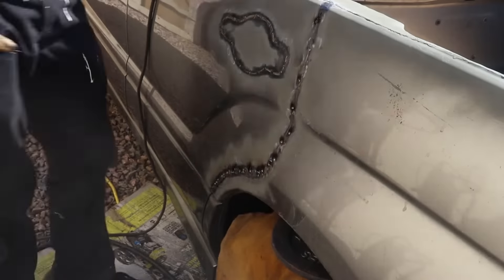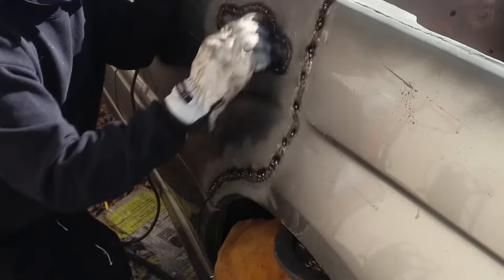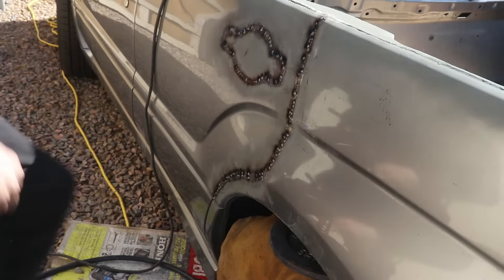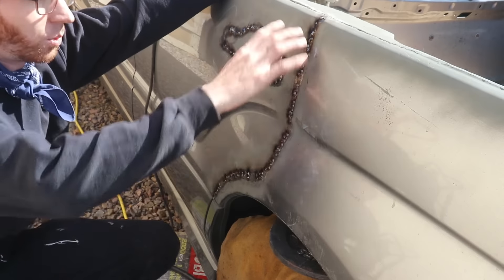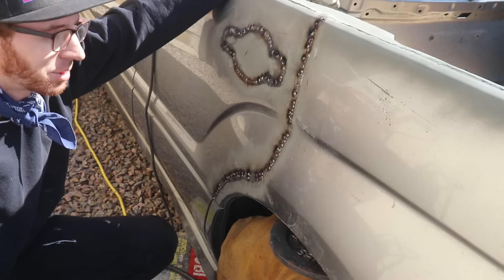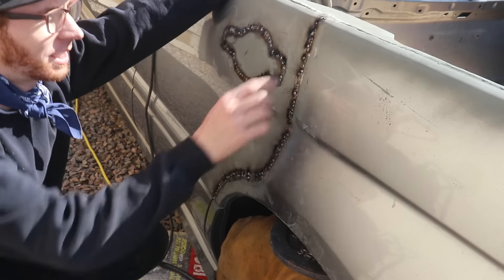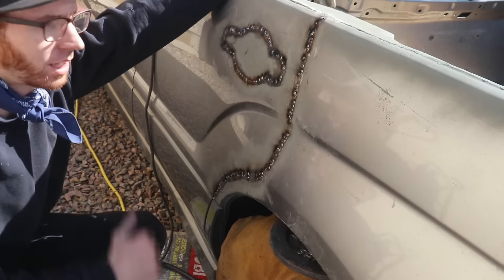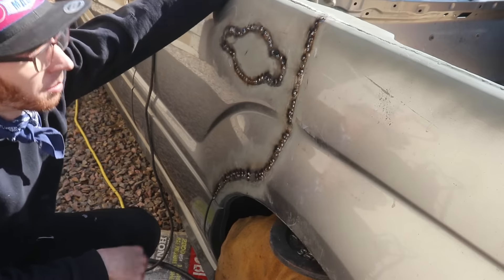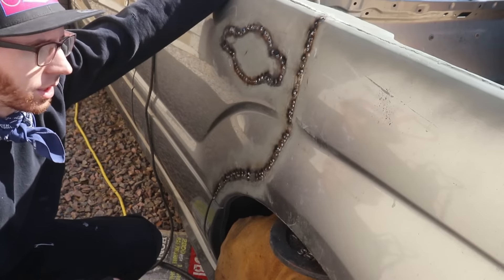One of the good things about welding up doors is there are so many bends in the metal that even in this thin modern sheet metal you can just spread out the tacks and grind back down. I had to use my body as a human shield to kind of block the wind — it's so windy right now that's the only option. I was waiting for the wind to die down and then weld the spot. I'm just gonna keep going on this.